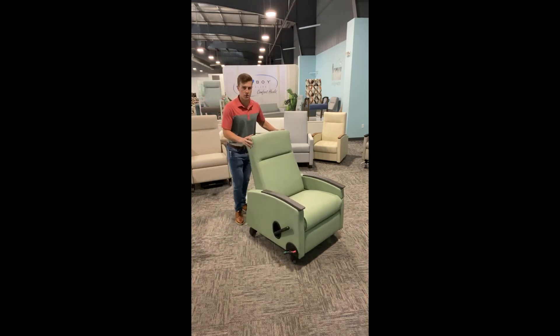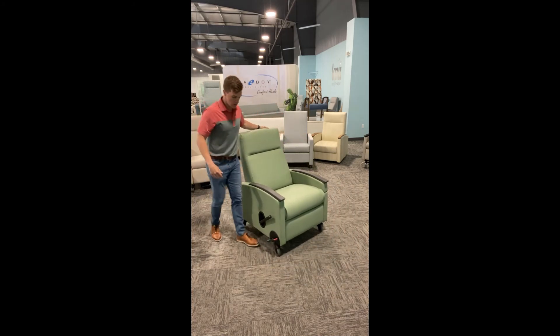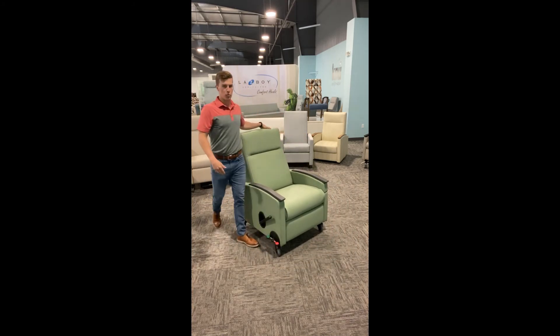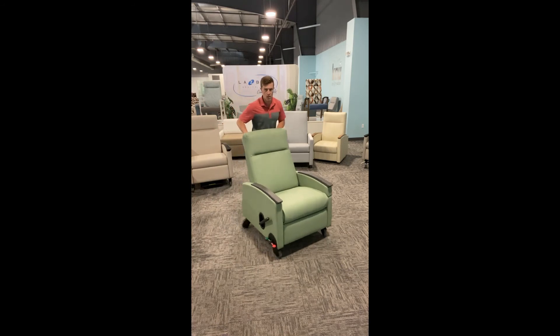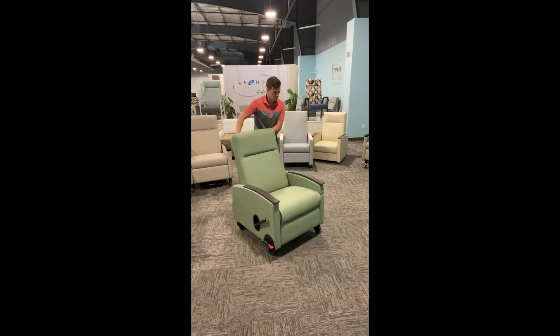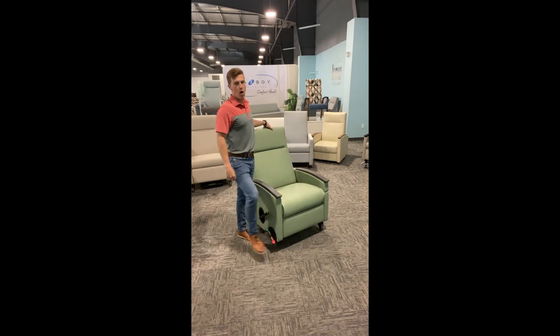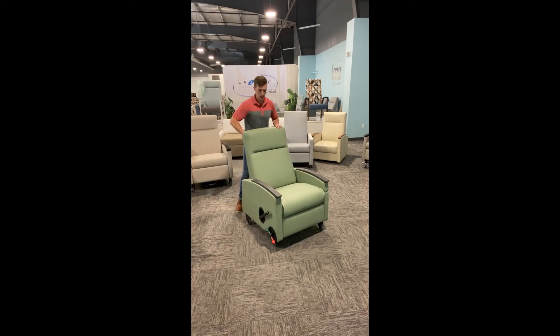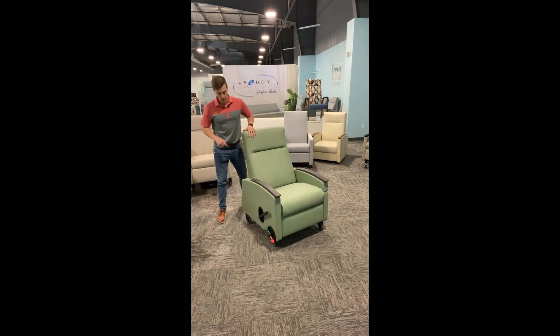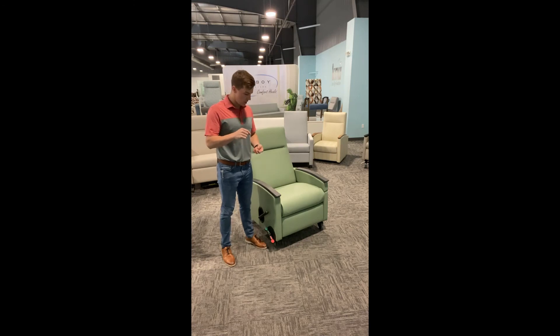In the neutral position, all four will be swiveling casters, so it's very easy to control. And then when I push the red pedal down, all four casters are going to lock. This particular configuration, the four caster lock and steer, comes available in three inch casters, four inch casters, and five inch casters.